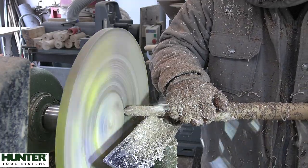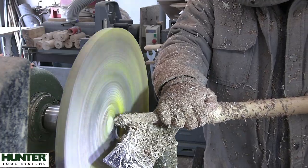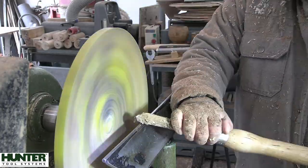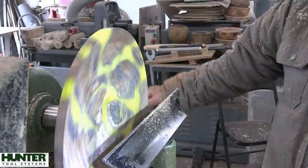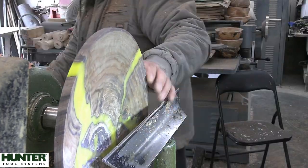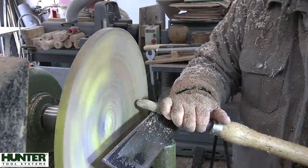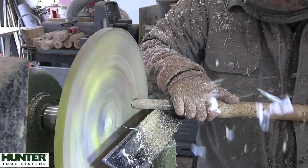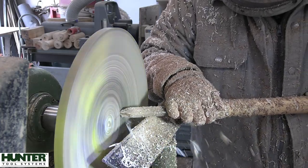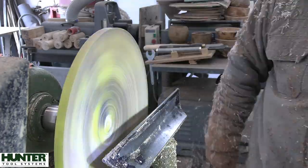So there's one. I do find that push cuts are maybe a little more aggressive than the pull cut towards you. I'm just checking for flatness here. By the time I get this done, do a little more profiling on the back and sanding, I'll be close to a quarter to three-eighths of an inch — that's what I'm shooting for. Push cuts are certainly more aggressive than the pull cut, so that's something to consider when hogging out material. There is a fair bit of kickback from the tool, so make sure you've got a good grip.